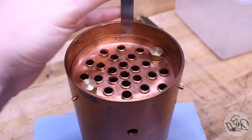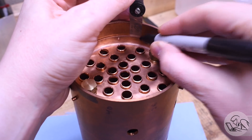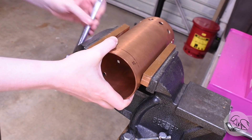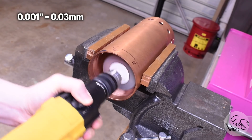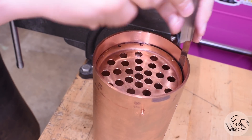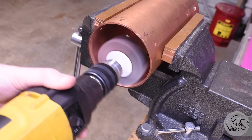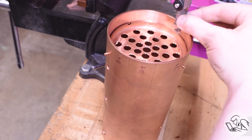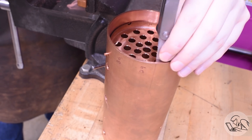One last bit of silver solder prep - I want to make sure I have clearance around the tube plate. I've got a 1.5 thou feeler gauge and I should be able to run it all the way around the tube plate, but I can't - it gets stuck in a few places. So I'm marking the outer boundaries of the tight spots and clearancing the boiler in those areas with a flap wheel. The boiler isn't perfectly round - not surprising since it's mass production copper pipe. When I'm close and want to get more precise, I mark the specific area with a Sharpie and use the flap disc just in that area; when the Sharpie mark is gone I check again. After a few rounds of that, I can now run the feeler gauge all the way around. If you don't have clearance all the way around, the silver solder doesn't have anywhere to go and it's going to be a leak or a bad joint.